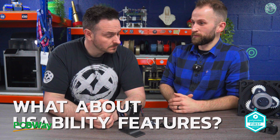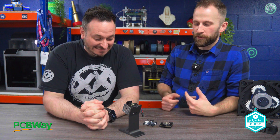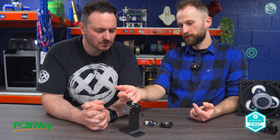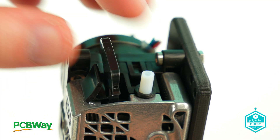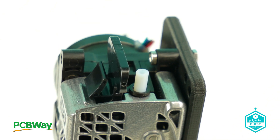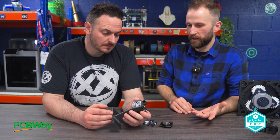One of the biggest customer service tickets we get for Hemera is people who've either under or over-tightened the idler tension. So we wanted to design that out because it's an obstacle to new users and also makes filament changing harder. We've got this geometry where as you click it, it locks — that disengages the hob so you can pull filament in or load new filament, then you simply pinch it and it re-locks together. You can obviously use scripts to automatically load if you want, but the manual change option is there for you to use.